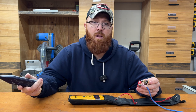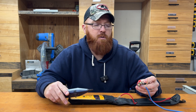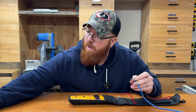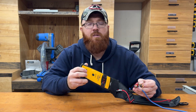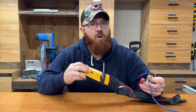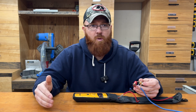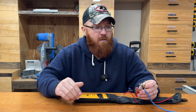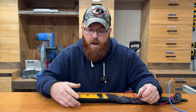Something else neat about that too: if you've got multiple of these units, these TS100s, or a couple of tone boxes, and you're wanting to get three, four, or five pairs toned at a time and you're by yourself, you can hook all those up with different tones so they're not the same. Leave those on one end, travel down to the far end, and ID those pairs. You can get as many pairs identified at once as you have tone boxes. Just a little pro tip after doing this for several years — the fewer trips, the better.